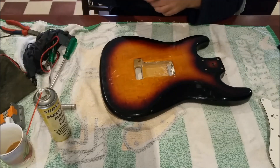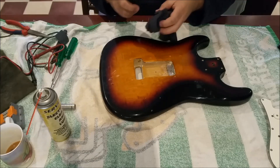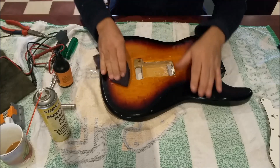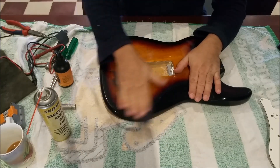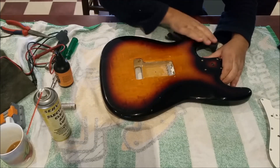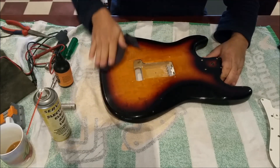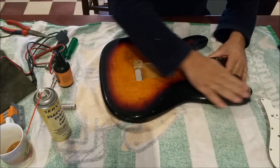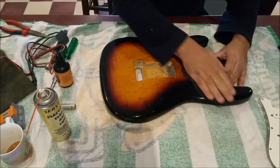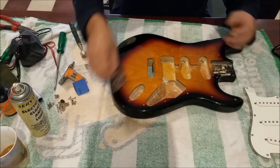So I'm looking at this thing and there's a couple of knocks in it - there, it's on the black part and I'm in two minds. It's not really black, it's like a burgundy almost, but it looks black. If there was a chunk out of it, I wouldn't think twice - I would fill it and clear the thing again. Key it back with some 320, 400, and just clear the hell out of it. But it'd only be worth it if it was a more valuable guitar like a Gibson or a Fender. This is a cheapie, so I'm not going to bother. But you could get a lot better than this by clearing it, wet sanding it back, letting it sit, clearing it again - flow coating it and buffing it.